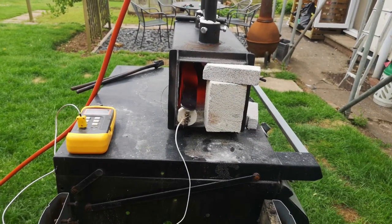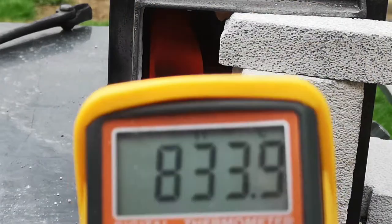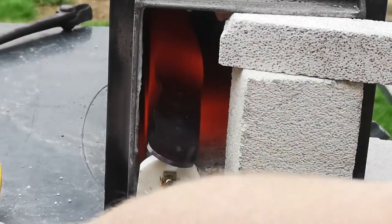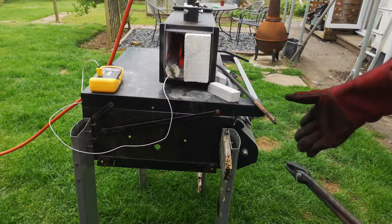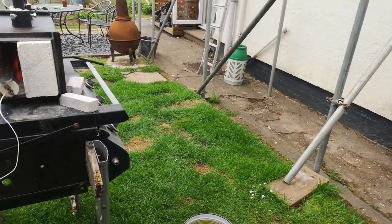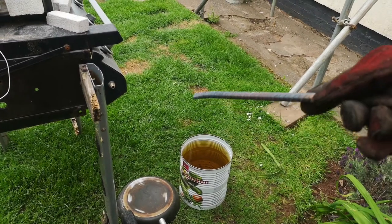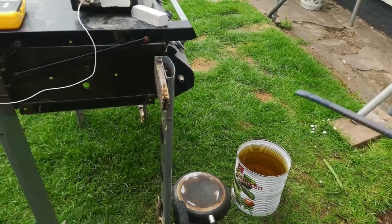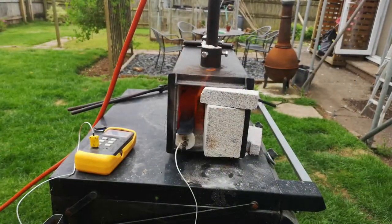The knife's warming up nicely and the temperature is climbing slowly. I want it at about 840°C, so I'm letting it rise nice and slowly, then I'll hold it for 10 minutes before quenching. I've also got a piece of steel in there to warm the oil up — you want it around 50°C, just hot enough to touch but warm, as that speeds up the quench rate.